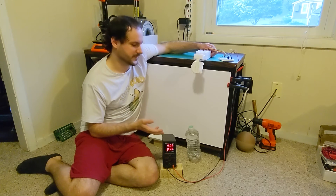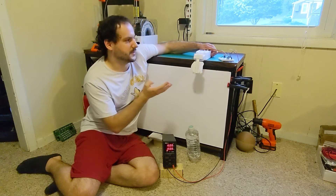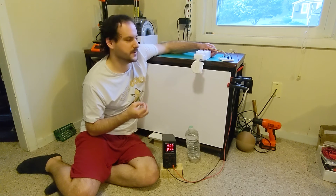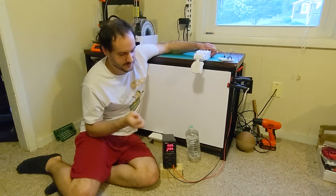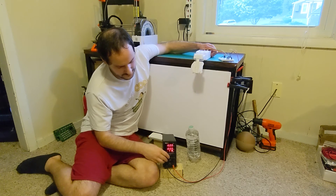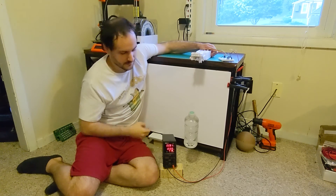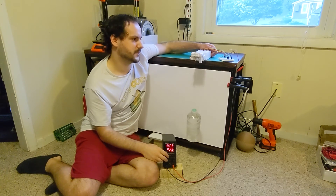As you saw, we can actively lift the one kilogram weight at 5 amps, however on this flimsy setup we melt the wire in seconds. Instead, we can make use of friction for our benefit and passively hold the bottle up using just one and a half amps. It's not enough to lift it so we will have to manually lift it, but it is enough to hold it up — and as you'll see, the moment I release the current the hand will drop on its own weight.